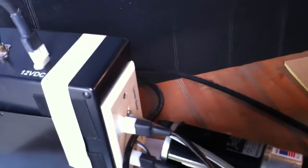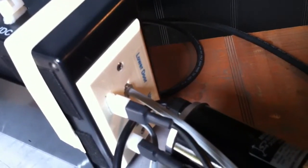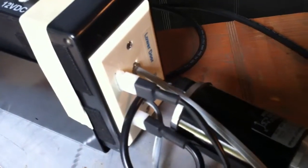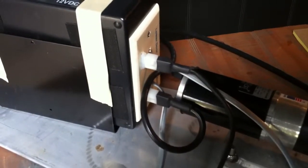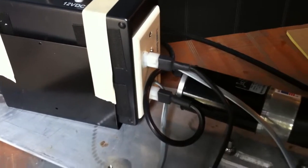Regarding the RJ11 cables from the limit switches, they're reversed. I have the lower limit switches plugged into the upper door slot, and the upper door limit switches plugged into the lower door slot. I also do not have the two short jumpers installed on the power leads to the motors because I think the direction of rotation is correct.